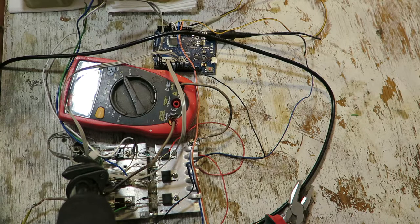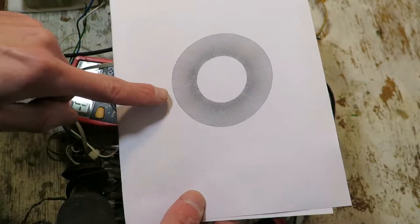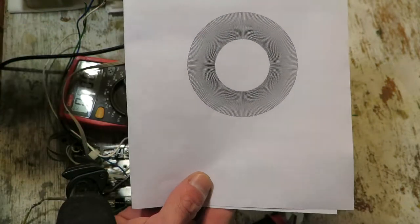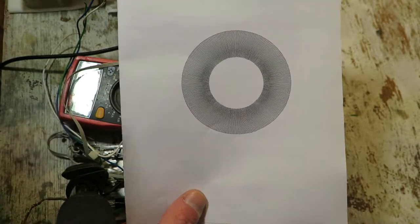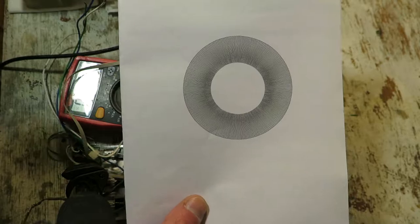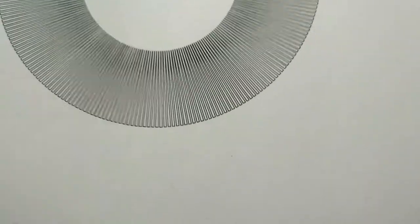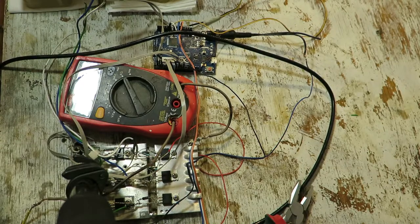Hey, you're still here, that's good. I wanted to show you something. I was thinking about using this thing as a beam interrupter for the encoder, basically. An optical sensor, the thing that you have maybe in a mouse for the middle wheel thing. And it's quite high resolution, this is about 600 impulses.